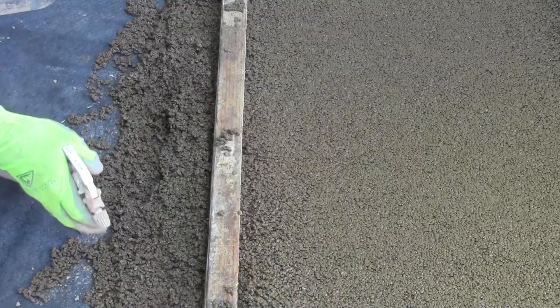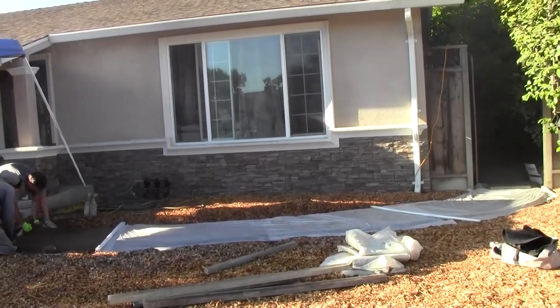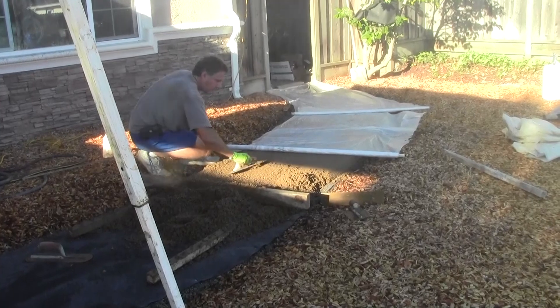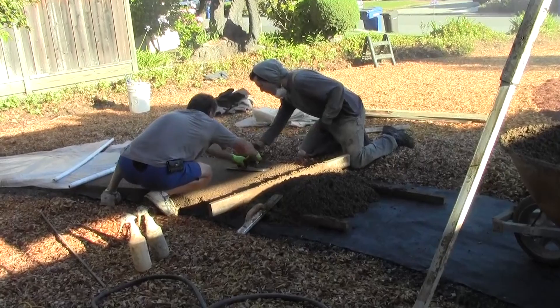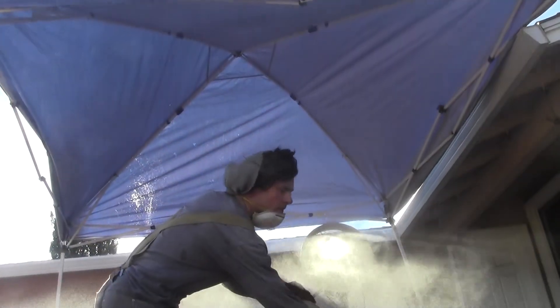As the morning gets a little warmer and drier, spray the pervious concrete that has just been finished before blending it with the next batch. This makes the older material easier to blend with the fresh material and helps mitigate any potential color or texture changes. Spray bottles make great misters for targeting specific areas. For this installation, shade and an automatic mister were used despite relatively good placing conditions.